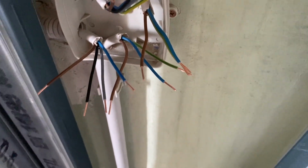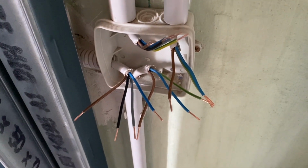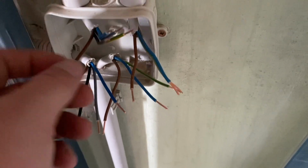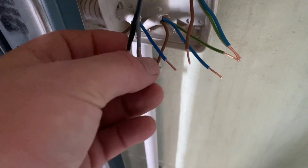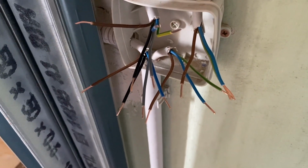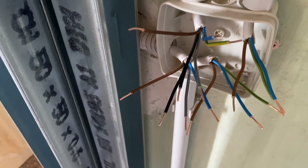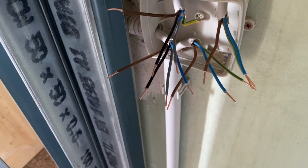So it's all just making sure that all of the circuits close properly. Here we'll be going black on black and grey on grey. So one of those will be live when we hit the light bulb. And on the other side, we'll have the switch, which will also have one of them run through with a double throw. So these 2 cables, the grey and the black, basically will go into the top of the other switch.